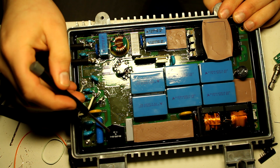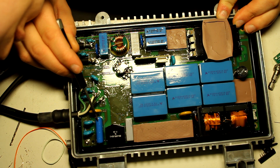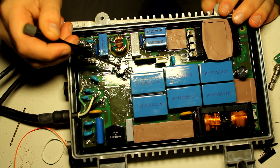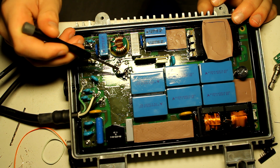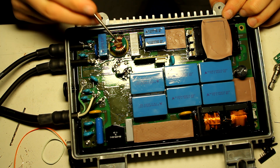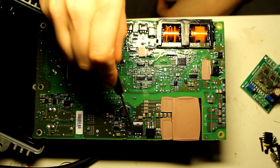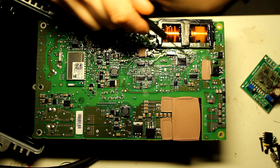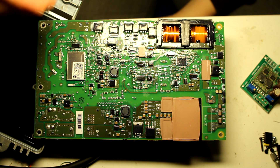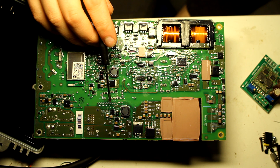There's some filtering, and I think this looks like it's actually an output. You would expect some kind of current sensing on the output. This is a capacitor - it says 630 volts. This might actually just be a current transformer, or maybe just a signal transformer because it's not in the current path. Let's try to get it out some more and see the underside, because this is going to be really interesting - there is so much going on on this PCB. This is where the DC comes in, gets upconverted, goes into the DC bus, and then goes out as AC somewhere here. There is a small control PCB which is almost definitely controlling this transformer situation.